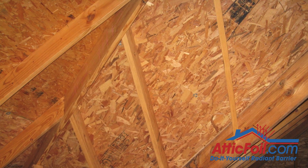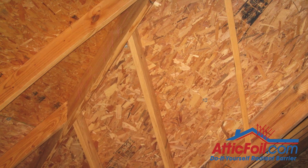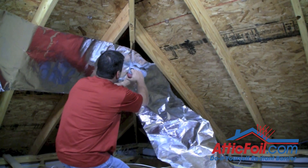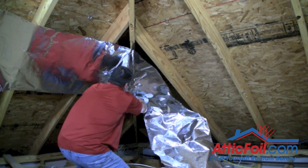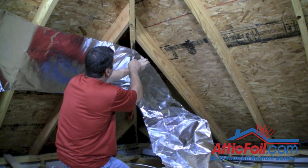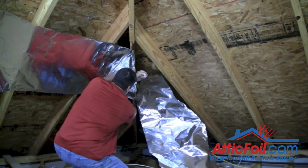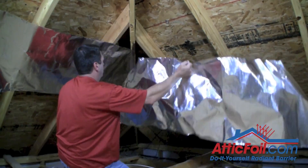The air will go underneath the blocking but continue to the top of the attic. A hip or a valley is usually in the corner where the rafters dead end at an angle into the corner, called a hip rafter. Here's a trick to get a perfect fit into a hip: run the foil across like you're doing a normal install, wrap it around the corner, and extend the foil five to eight feet — a couple of rafters past the corner. Then cut the foil straight down, using that hip rafter as a cutting board.